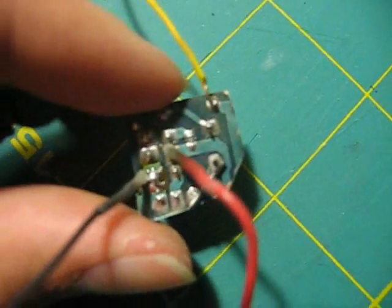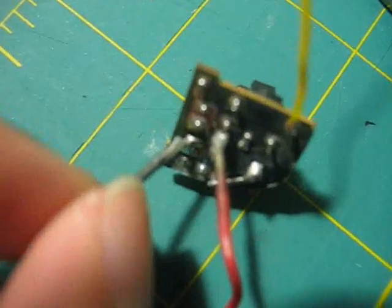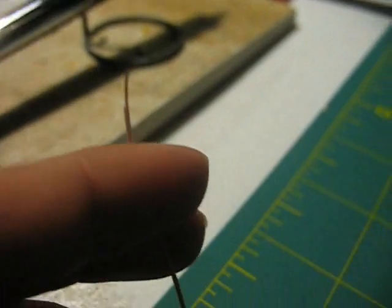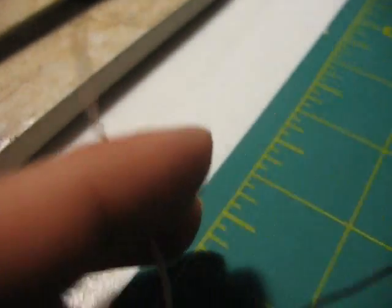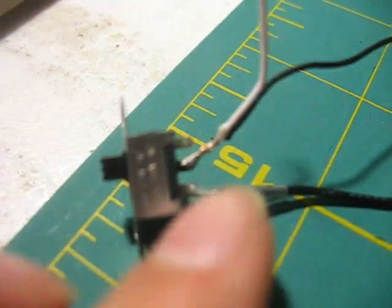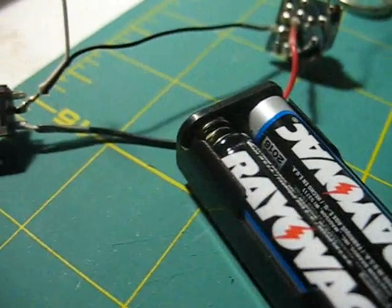Now that's all the wires you have to put on here. You get this black wire that's attached to that hole and you connect that to another wire, which will be your positive high output. Those two are soldered together to a switch, as you can see here. The other terminal of the switch is connected to the negative of the battery, and that's all there is to it.